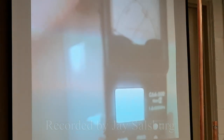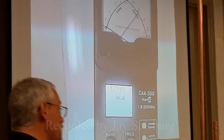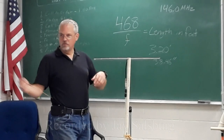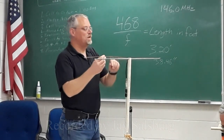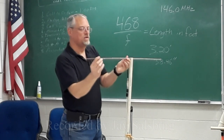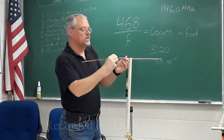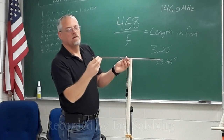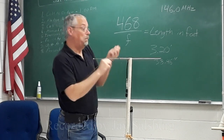So I'm going to try something. I'm not sure a lot of this return loss in that skinny section too. So what I've got here is just a quarter wavelength. So what I'm going to do is squash that down, and I'm going to go to the thin side. Will that make any difference?